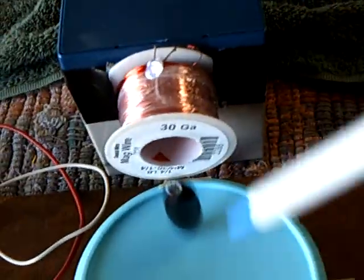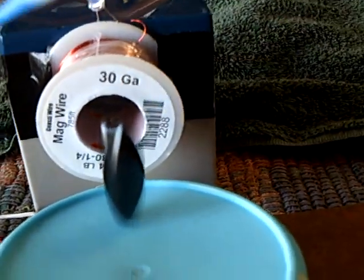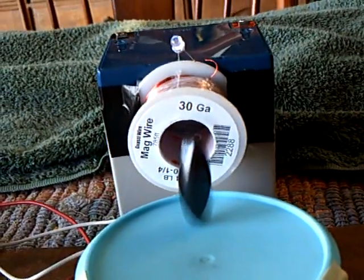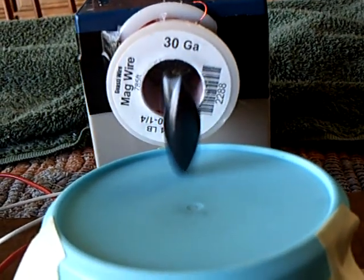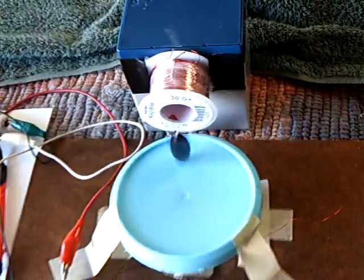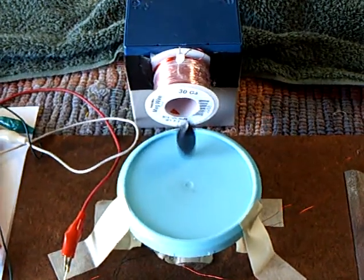I have to start it up on a 12 volt battery — I can't get it going on this small battery — but once it's running I just take the 12 volt battery away. You have to use an air core coil. Some guys are using four of them around here to pick up the energy; I've just got the one going. If you try to use an iron core or steel, it just attracts the magnet and everything comes to a grinding halt. So that's the latest on the Snake Egg Bedini.